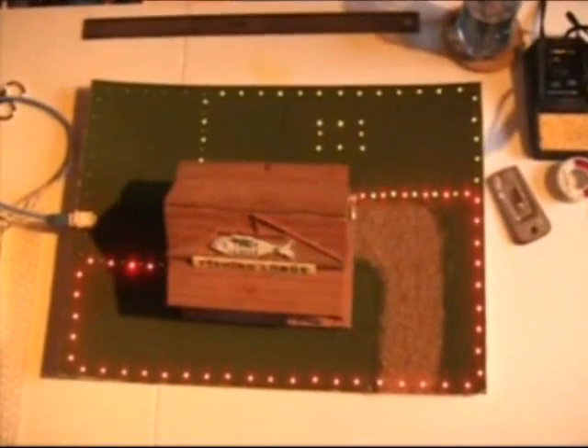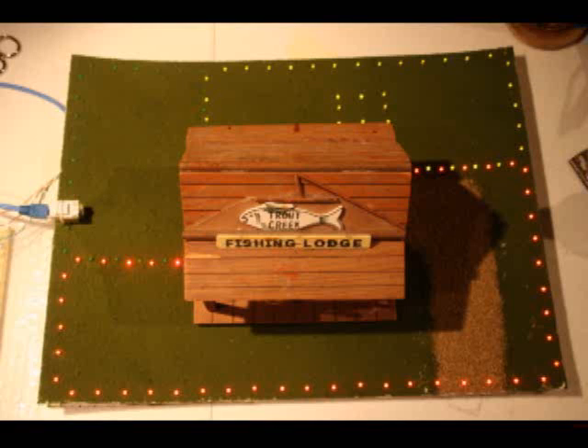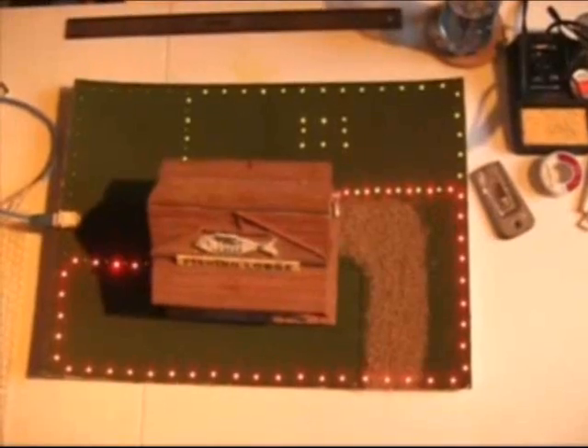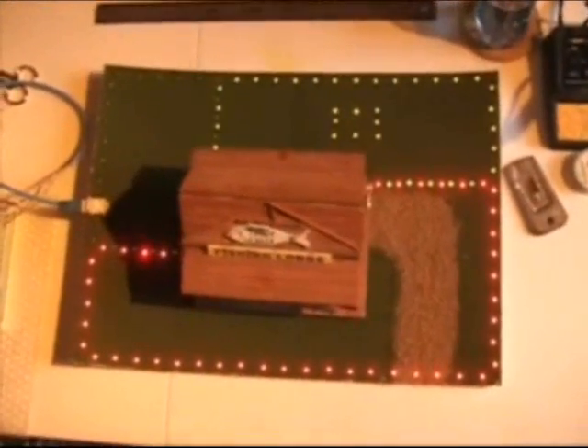Since it's impossible to see an invisible dog fence in action with one's eyes, I decided to build a model yard for the project that is similar to the zone diagram we just saw. The zones are indicated by different colored arrays of LED lights. Since each of the LED arrays is on a single electrical circuit, we can easily simulate the invisible fence zone, as both only require a closed loop to operate. In the model yard, the radio signal is replaced by a DC current, but since all we really care about is continuity in circuit, the same hardware and software designs will work for both.